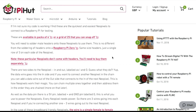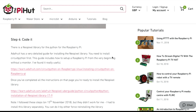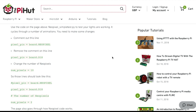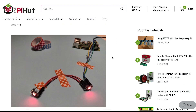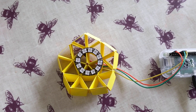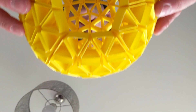I followed tutorials on the Pi Hut and Adafruit's websites to get the Pi up and running with CircuitPython, a version of Python designed for microcontrollers. Amazingly, this went without a hitch. Once completed, it was relatively easy to get my Hello World on — or should I say, get my Hello Green on. With 12 LEDs and 16 million colour combinations, the possibilities were endless, and before long I had coded a few sequences and managed to sit the NeoPixel ring in the base of the lamp.